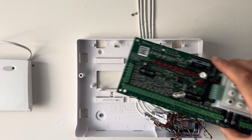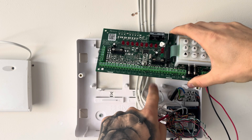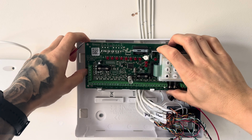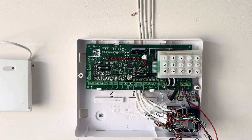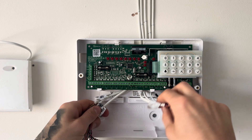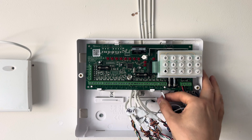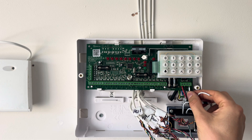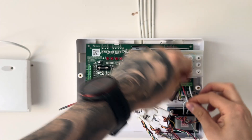Let's get on with the circuit board. Get the PCB and you'll see two white lines here, and what they line up to are these two parts here. You're just going to want to pop them into those two parts there. This bit here will then pop through the circuit board, and then simply push the panel back into place until you hear it click. On this panel we have a bell cable, a hall cable, a kitchen cable, a landing cable, and a bed panic alarm cable.